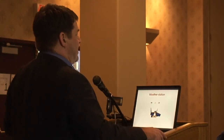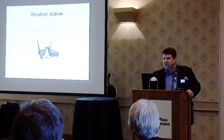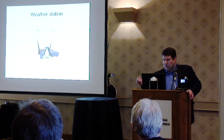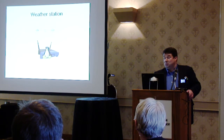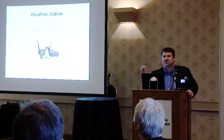How about making a little miniature weather station in your backyard? When you check the weather on TV for Calgary, what do you get — temperature at the airport? Temperature at the Husky Tower? I want the temperature in my backyard. So why not connect a temperature device to your Linksys router, put it in a weatherproof box, and broadcast local weather to people within range? The WRT54G and GL actually have a couple of uncommitted digital I/O pins — an ideal place to hook a temperature sensor the size of a transistor.